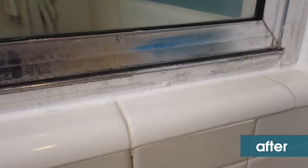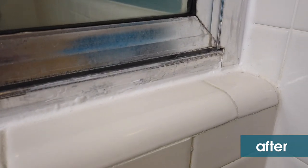Here's what we learned: you probably saw in the video that the aluminum frame around the glass was really discolored and pitted in many places. In our research we found out that someone likely used a harsh product on that aluminum — something like CLR, Lime-Away, or even vinegar. All of those can eat away at soft aluminum, and once it does that damage is permanent.